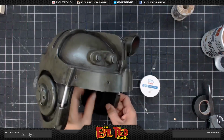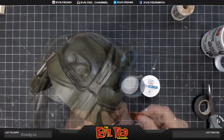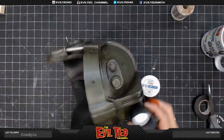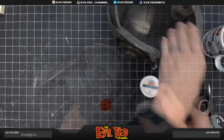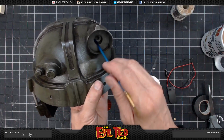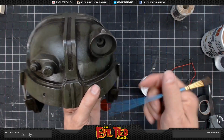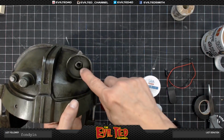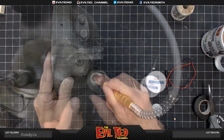Now these guys are soldered, let's go ahead and turn the light back on. Yeah, see, a little bit of a space there, but oops. What I've realized is that I cut this back so the LED would have distance, but this is catching. What I'm going to do is get in here with my rotary tool and grind this out just a little bit.